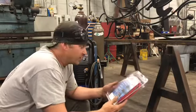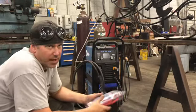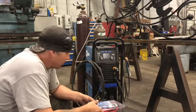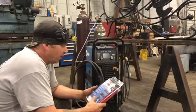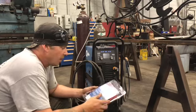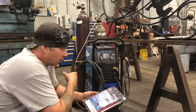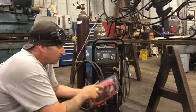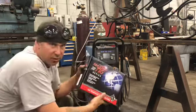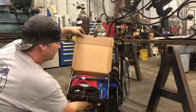Our new parts finally came in from CK Worldwide. Today we're working on the Miller Multimatic 220 AC/DC machine, and it wasn't really meant to be water cooled, but where there's a will, there's a way. CK Worldwide is my go-to people anytime I need any water cooled torches. They have a special DINSE plug that will plug into this machine where the TIG plug goes, that has the hole in the center of it, and it has all the water recirculation lines to where we can plug in one of their brand new CK230FX flex head torches. So check it out, it's beautiful.